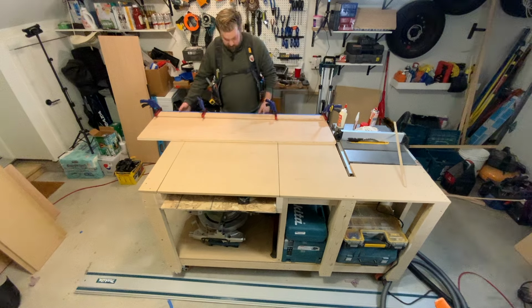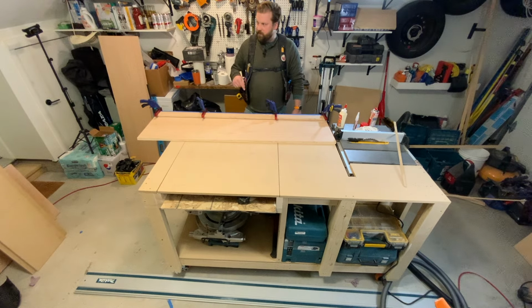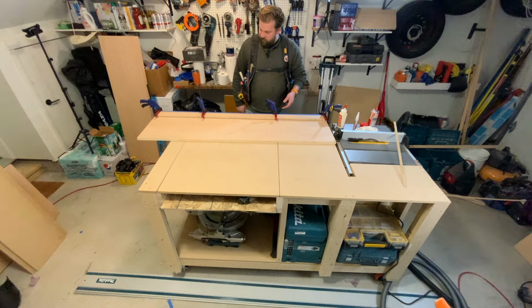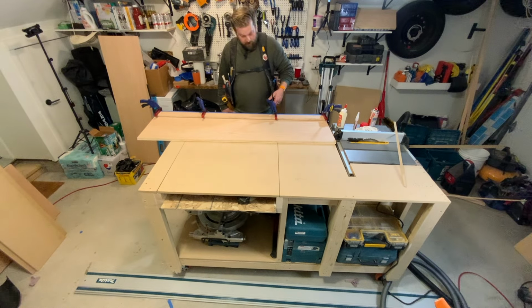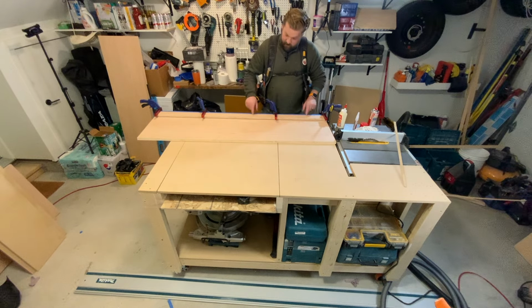I'm kind of developing new practices as I go along. Each of these pieces that I built using the miter technique, they're all glued together a little bit differently. The first one came out absolutely beautifully. That one I used just tape and instant bond. The second one, I used Instant Bond on one side of the center braces, and then I wood glued the other side, clamped it, taped it, left it overnight. That one didn't actually turn out that nicely.